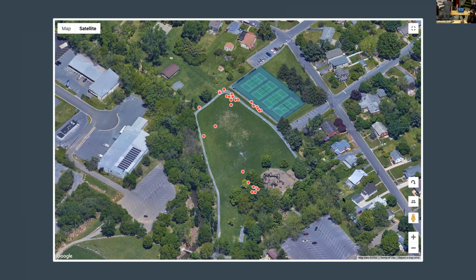One thing to note is that in the middle of the picture, there's grass, but it's kind of brown because there's not that much grass. We actually walked straight in a line, and it didn't pick up any of that. So, what was the reason? It's hard to say what the exact reasoning was, but I think a lot of it had to do with the fact that either we stepped a little bit too far away, or it wasn't direct line of sight, because the code yesterday was only sending one packet transmission and calling it good. It wasn't confirming that the receiver had actually received the message. I think we just lost those packets because there was no communication at that time. After that, I established the two-way confirmation. But it did work, and data did go to the website. That's what these points are telling us. Also, maybe the dog was super fast.